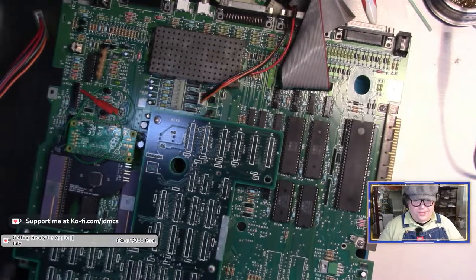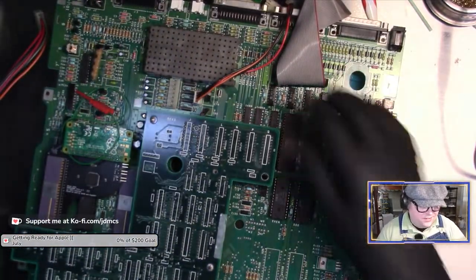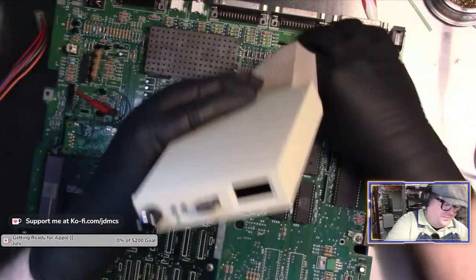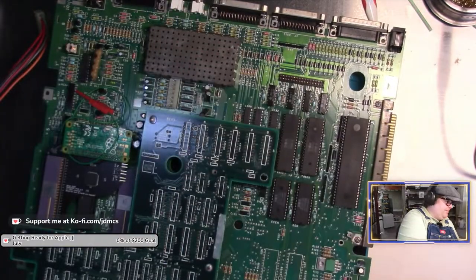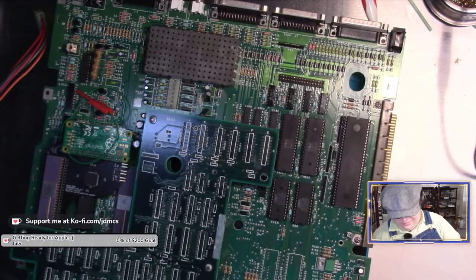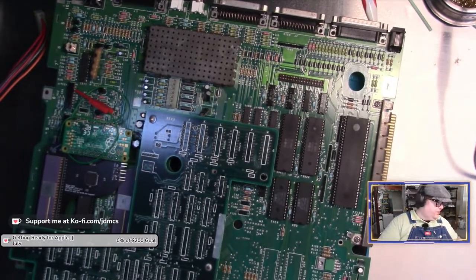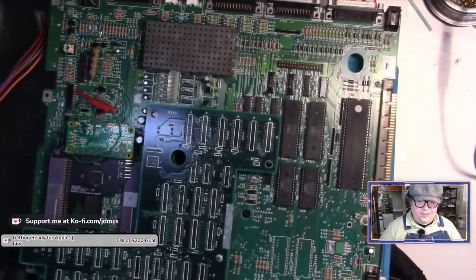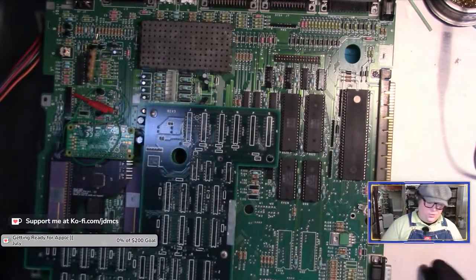Also, if you don't plug the memory expansion board in the front of the Amiga in properly, you will probably get a guru meditation. I pulled the DKB Insider board off because I wasn't sure if it was the cause of the guru meditation in sysinfo, but it turns out it was the improperly inserted front memory board.